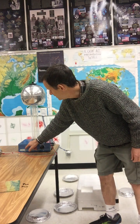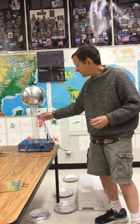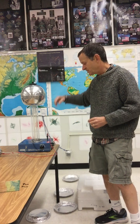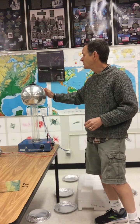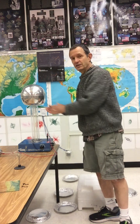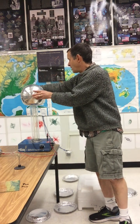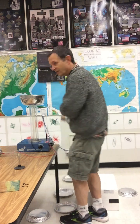So if this thing stops charging, you want to clean that tube out really well so that you get gunk out of there, like little bits of the rubber belt. Clean that tube out. Just take it all apart and run a towel through there, clean that up. Polish the outside of this, get some cleaner, and polish the outside of it. If there's rough edges on there, get rid of those rough edges because those will spray charge into the air. And then you can take this top off.